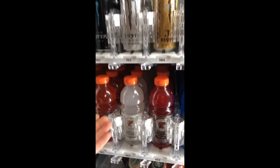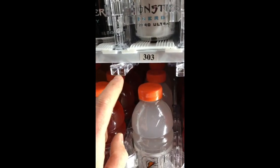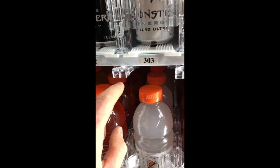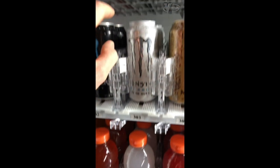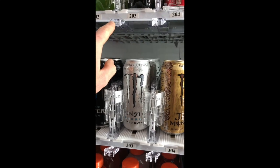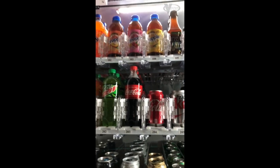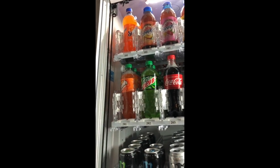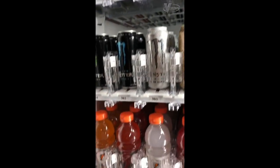So what was going on is the picker cup is coming up to a target, and instead of hitting it anywhere on here, it was hitting a few sixteenths of an inch below — maybe even a quarter of an inch below each target. Every now and then it would actually hit one or some as it would get further up. Sometimes it would actually catch the very bottom of it, and on the very top tray it actually would catch the bottom most of the time and bend those up there. But the rest of the time it was way too low.